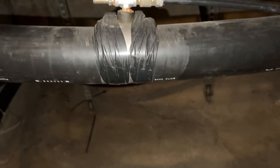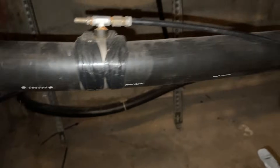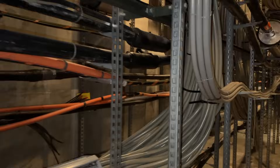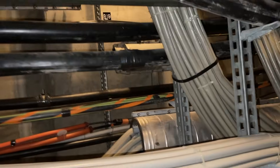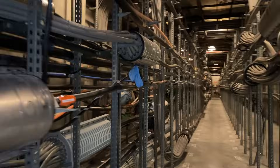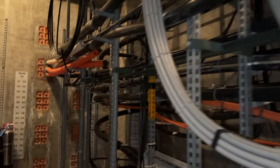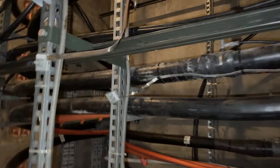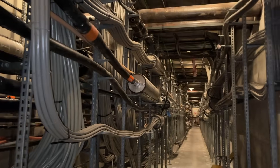This particular cable is a pressurized cable, so they feed it with air or nitrogen in some cases. That helps keep the water out. Air pressure is an older style of technology — there's the splice or sleeve. What they use now, and there's not a lot of copper going in either anymore, is a gel known as icky pick sometimes. It's just this really nasty gel that gets all over your hands and it keeps the water out. Think of irrigation valves for sprinklers — that kind of oily, greasy substance. It's basically what's in these cables if there's not air pressure in them. But if the air pressure is in them, then they have these compressors that pump air constantly in them and keep the water out.